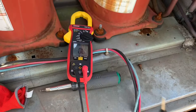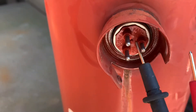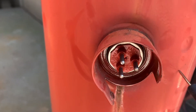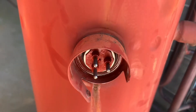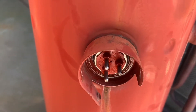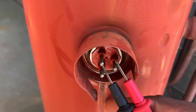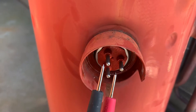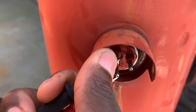This compressor is three phase, but it doesn't matter. If it's a scroll compressor, a rotary compressor, or a hermetically sealed compressor — these are the most popular compressors you'll find in an AC unit — there are going to be three terminals. You'll check for continuity across all three terminals in pairs at a time. That should be ringing out.